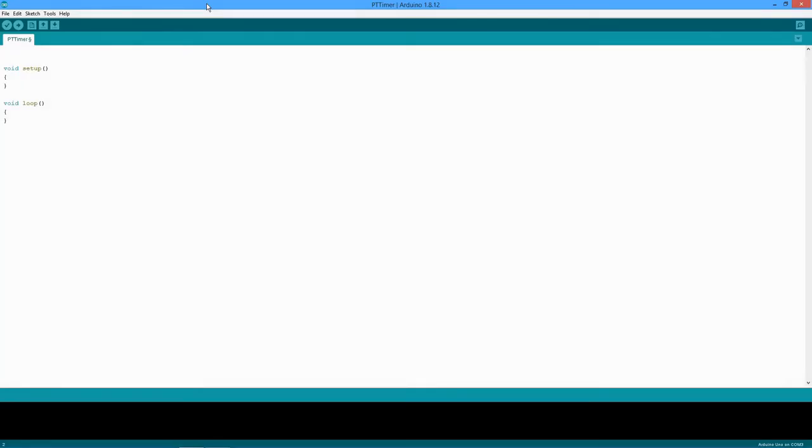Okay, so here's the Arduino editor open full screen. And what you'll notice is we have two little stub functions in here called setup and loop. Now, this is referred to in Arduino parlance as a sketch, not really a C program, but ultimately it really is. Now main, which you don't see, has already been written for you.